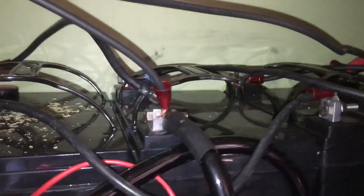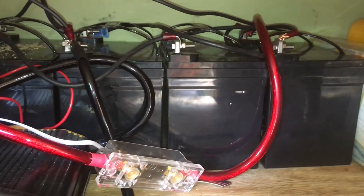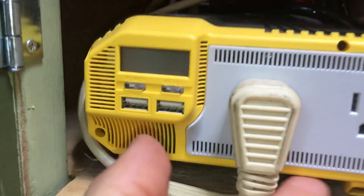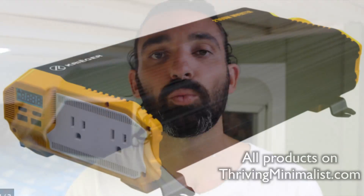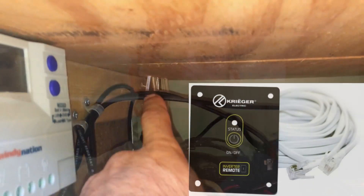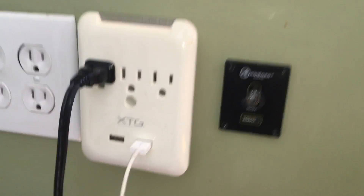So the first step is it goes into this control system, which then hooks up to four six-volt golf cart batteries. Those are being charged by the sun and get restored every time the sun is out. All of those golf cart batteries are connected and linked up so they're operating as one source of energy. Then we have two wires coming from those batteries running into the inverter. The inverter is responsible for inverting DC energy into AC energy. We sprung for a really high-quality, high-capacity inverter. One extra-cool feature is that it links up to a phone line about 20 feet long so we can control it with an on/off button almost anywhere.